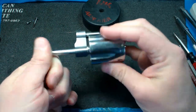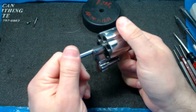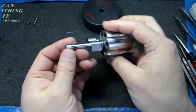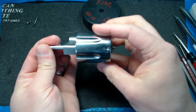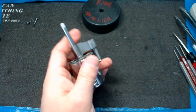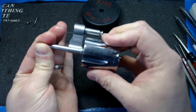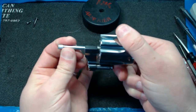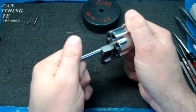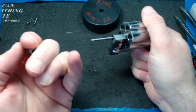There's a great deal of debate about the right way to design these, but what we're going to do is remove the ejector. The ejector is screwed in, and depending on whether the firearm is left or right-handed — meaning whether the cylinder drops out to the left or right — that changes the threading direction. On this one the cylinder turns counterclockwise, so you want the rotation to always be tightening, not loosening the extractor. This one is essentially left-hand threaded, so we turn it to the right to unscrew it. Not all revolvers are like that — Smiths tend to go one way, Colts another.